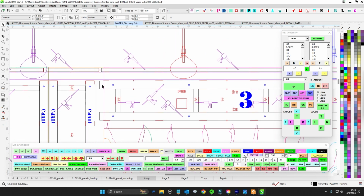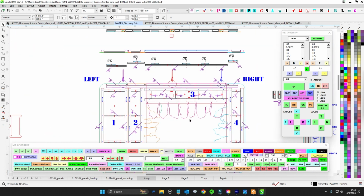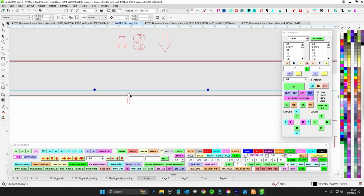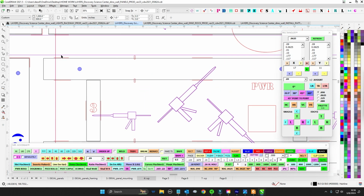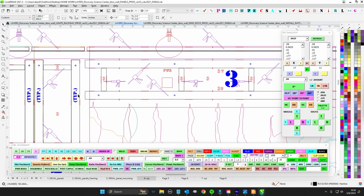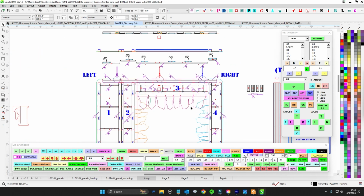So that's when you go to do the mounting bar up top, and you go to do these panels left and right. They will have little notches in them like that. You see that? These right here will line up. And that will give you your left to right alignment, and then you just make sure your up and down is within these bend scribes here, or these reference kiss marks here. That way we're good to go.